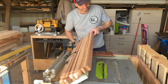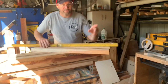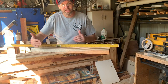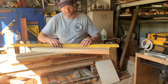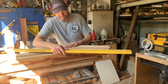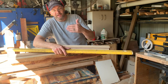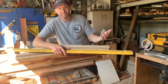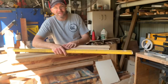The reason for using the jointer or the table saw sled to get that first straight edge is that often the clamps will actually pull the boards out of square. You'll hold a square up to them and they'll be completely wonky depending on how thick the timber is you're using. So that gives you your first straight edge, so you can then cut nice parallel cuts. That is going to let me use these slabs like bricks — they all go together nice and square and make a nice clean tabletop.